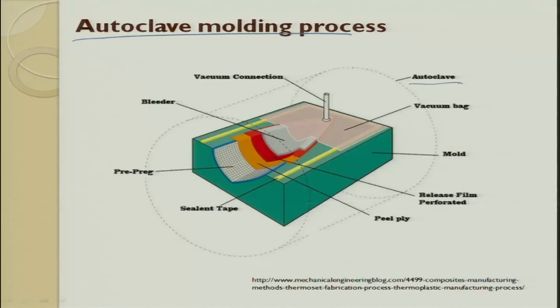Very large components are made this way. The autoclave is a furnace where pressure, time, and temperature can be controlled to get the best output. You can have a negative mold or a positive mold. For a component shaped like an inverted U, the mold becomes convex and you repeat all the same process — prepreg, bleeder, peel ply, releasing agent — and apply vacuum to get the required output.